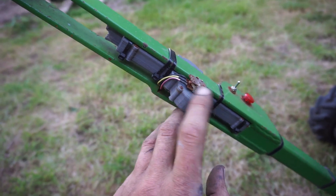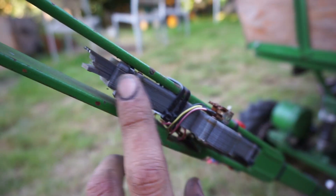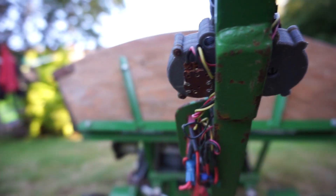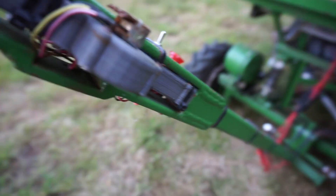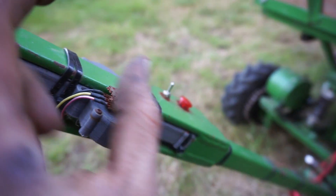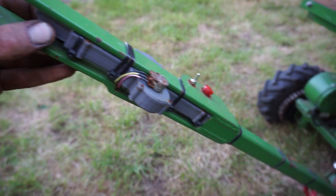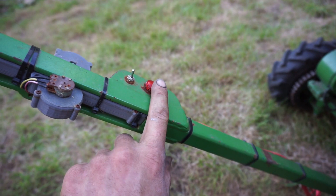This assembly had to exist basically because I had two potentiometers and I couldn't electronically figure out how to join them together. So I thought, I'll just mechanically join them. I 3D printed this housing here, which has got one potentiometer on one side and a spun 180-degree design on the other side. Inside these round-looking bits there is a gear, and they run on this rack that runs through there. You just adjust the potentiometers slightly to tune it in — they seem to have quite a wide band, so it works fairly well. You're either stopped or flat out when trying to go somewhere. And then you've got your on/off switch here and a light to show it's on.